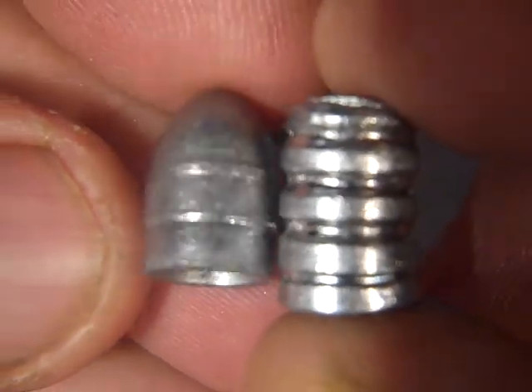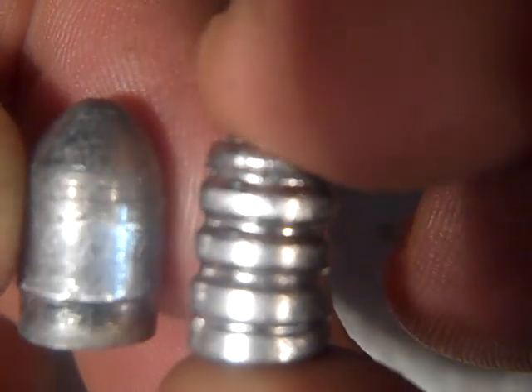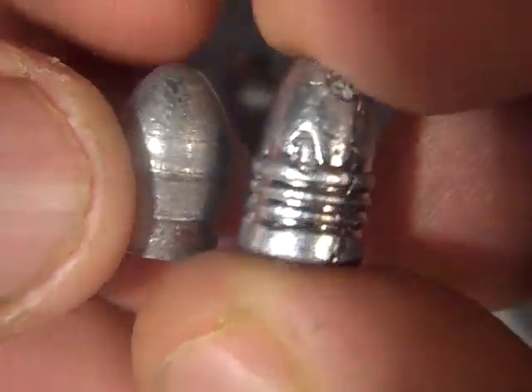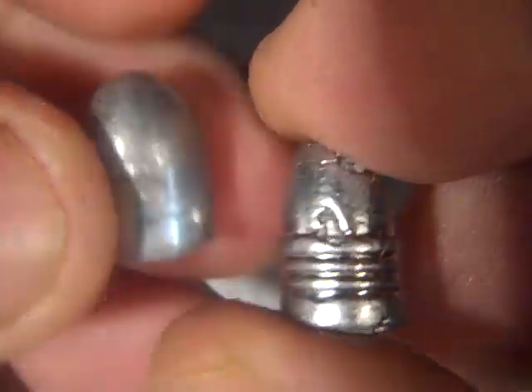This one ended up making this after swaging. I swaged it to a smaller diameter in a different swaging die, then powder coated it, then swaged it to the correct diameter. Same thing with this — I swaged this to get rid of the grease grooves because they make funny lines when you powder coat that first and then swage it. So I swaged this to a shape similar to this, only undersized, powder coated it, and then final swaged it.